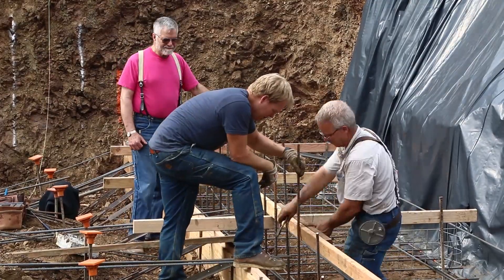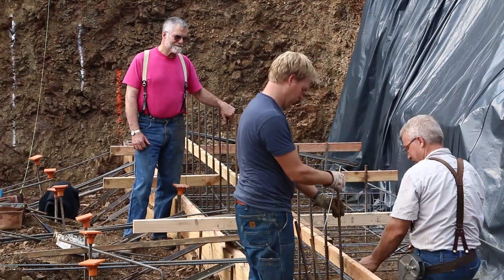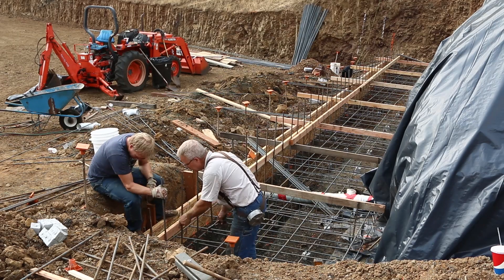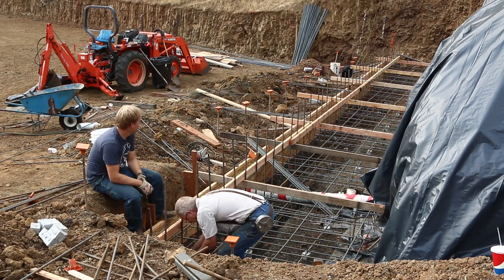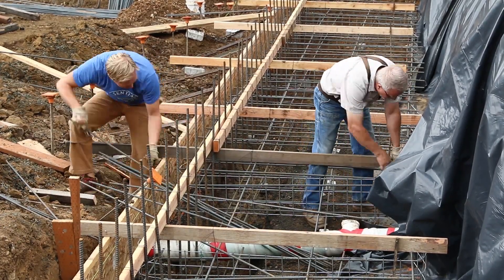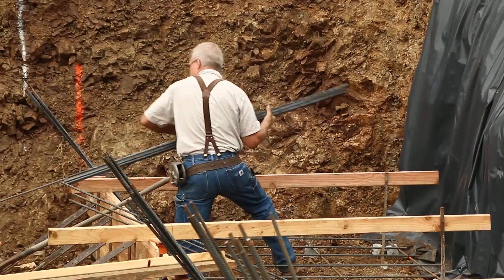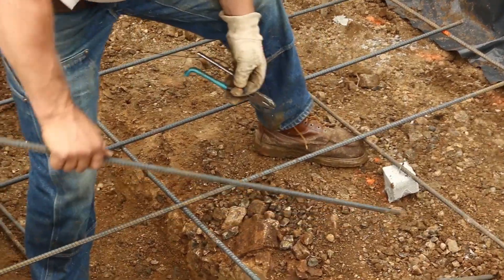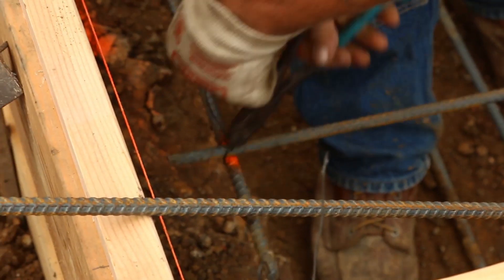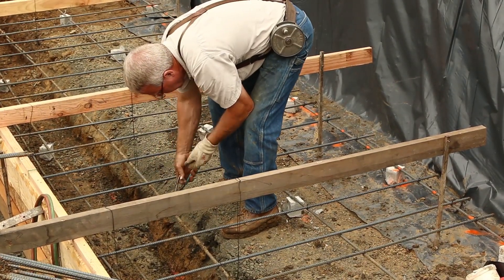I will attach the verts exactly 12 inches on center. They must be embedded to exactly the right distance into the footing, or perhaps a little more as they reach down into the keyway. It all has to be done in a way that I can eventually take apart — the template strips right along with the edge forms. I'll wait probably three days, which is enough on something like this. Keep in mind: even though engineers tell you all the details and specifications of your structure, they never try to tell you how to do it. That's your problem, and sometimes it's a real problem.